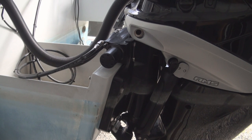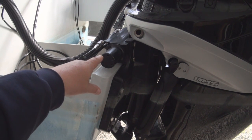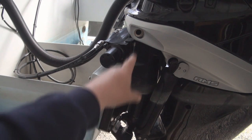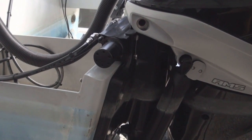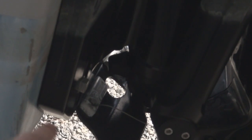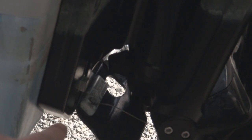On close examination you can see that the steering ram is actually an integral part of the mount — not just the ram but the pivot piston that runs up and down inside the mount as well. It handles really well in the water, just a couple turns each direction on the wheel. There's also a cathodic protection system that feeds current to the frame and the motor while it's in the water, which helps with galvanic corrosion situations as well as the zincs.